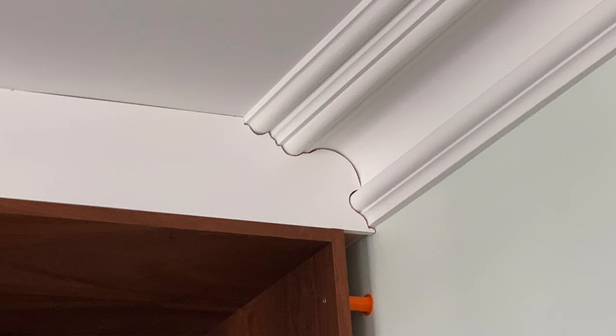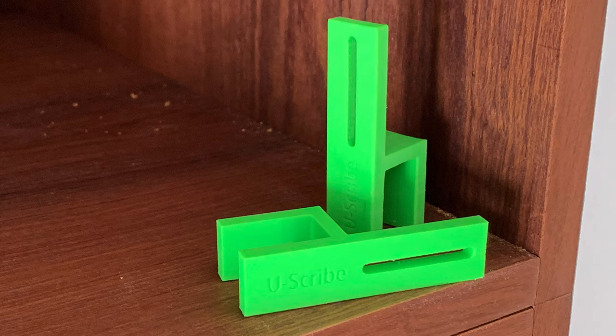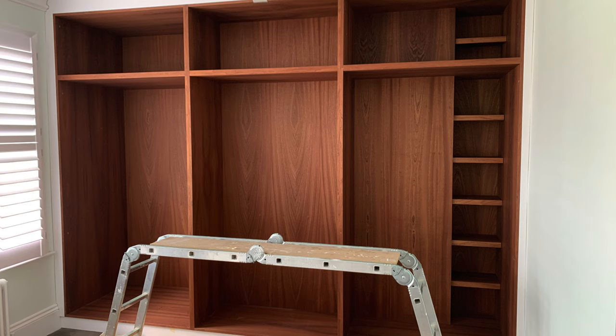I can then scribe the one expensively sprayed infill that I have — no pressure! All this took much longer than I'd like, and I ended up with quite a lot to do on the last day. Starting with scribing the side infills — a shout out to the guys at YouScribe and the block scribe jigs for making this a much easier process. I'll have a scribing video out soon so keep an eye out for that. With the side infills completed and a little caulking done I can bring in the shelves, first fitting out the narrow right-hand side wardrobe recess, then the full-width shelves in the left-hand wardrobe, and the top box shelves.